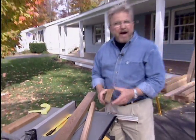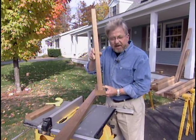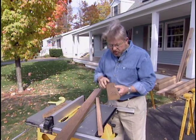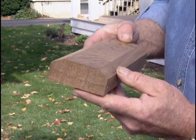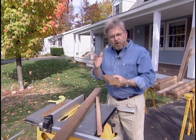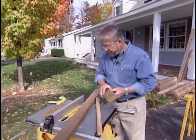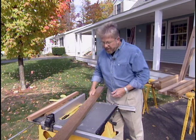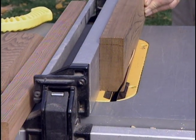Now we're going to make our bottom rail from this piece of 2x4. We could use it just like this and put the spindle on top, but I'm going to make a slight modification. I'm going to cut the corners off, forming chamfers right here and here. 2 reasons for this. One, I think it looks really nice, but more importantly, it allows any water that hits the top to more easily run off to the side. Now we're going to make this cut on the table saw. Got the blade tilted over at about 30 degrees, and I'll run the wood through on edge like this.